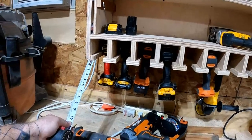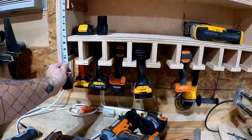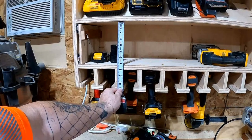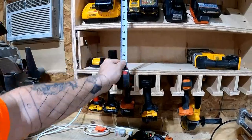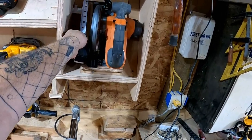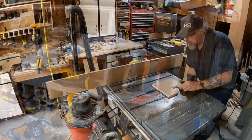This piece right here is 3/4 by 3/4 by the 9 1/4 deep. This, of course, right here is 9 1/4 deep by just short of 6 3/4 tall to fill this. So that shelf there is right at 7 inches from the bottom of this one. 7 3/4 from there to there. And then it is 9 1/2 wide, 9.5 by 16. And then whatever you want.